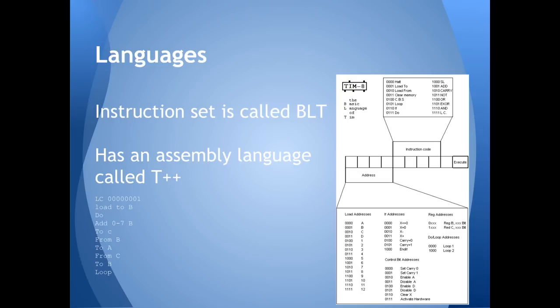There's a lot of interesting working-around on the punch tape, but I think it's technically Turing complete. Turing complete is quite a difficult definition of all the different things a computer has to be able to do. But with conditional branching — the if statements — and looping, it can kind of do nested loops. I did write some ridiculous programs for this thing, including one that could do full simultaneous equations using matrix algebra, which would have been about 10 meters of tape. I wrote an assembly language simulator so I could run programs on the computer first before printing, because debugging on paper tape isn't fun.